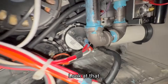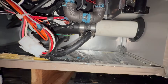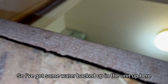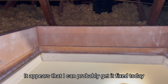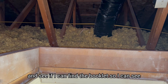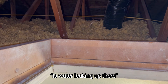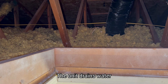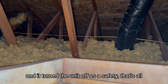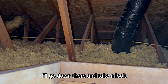We're not draining. Look at that. I've got some water backed up in the unit up here. It appears I can probably get it fixed today and get you some heat. The unit drains water and one of the tubes just had a little bit too much water and got backed up. There's a pressure switch and it turned the unit off as a safety. We just got to see how the drains are run.